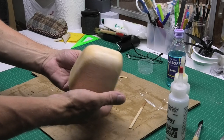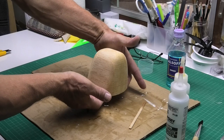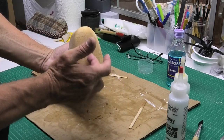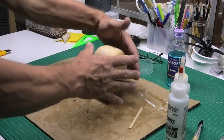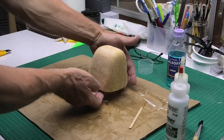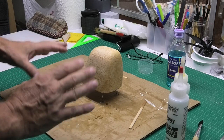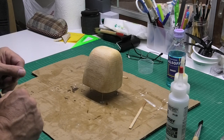I've got this plug which I'm quite happy with the shape and size. I did try and heat shrink a plastic bottle over it, but the bottle was just a little bit too small. I tried putting a slit in it where I knew I would need to cut out for the engine, but it all went horribly wrong — the bottle started to split as it shrank. So after a bit of thought, I've decided I'm going to try and make a fiberglass one. So I'm moving on from the shrink plastic onto fiberglass.